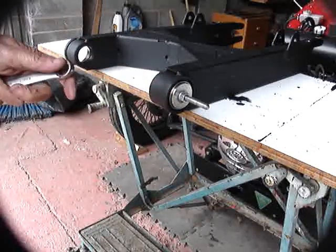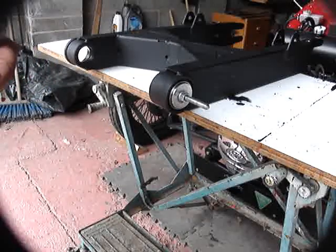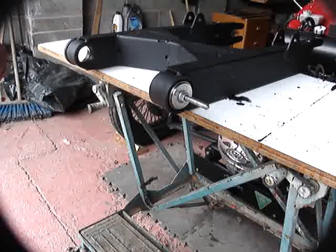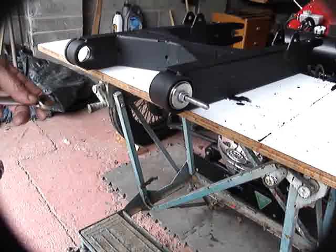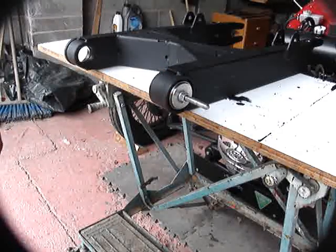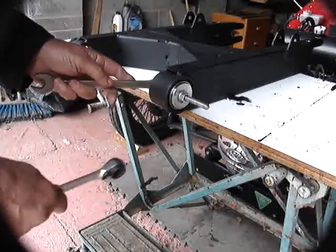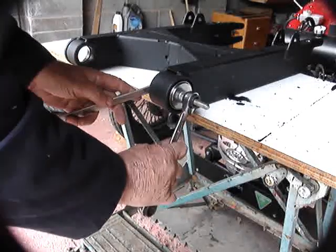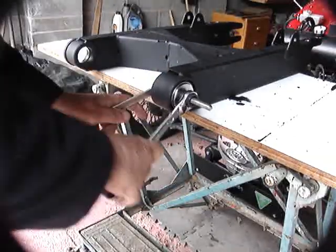I've inspected the two bearings and discovered they are in good enough condition to use again. If they'd been in a high speed, high load application I might be tempted to change them, but working in here they're not even revolving, so I don't think there'll be any problem whatsoever. The big danger with oscillating bearings like this is false brinelling, which starts to break up the surface of the races - but there's no sign of that on these yet. So I'm quite happy to put them back in. I'm pulling them back in with a length of studding and a couple of plates turned up with spigots on them to keep them nicely central.